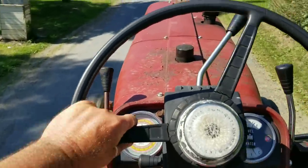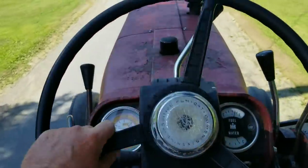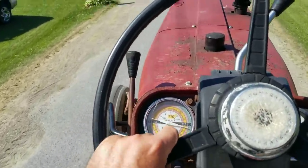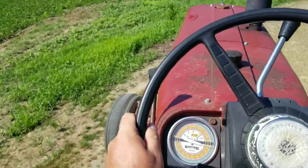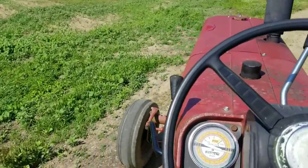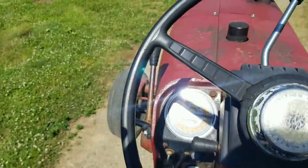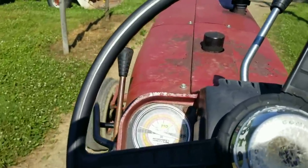You ever own one of these tractors, you want to keep them in direct drive, keep that lever forward. I see a lot of them parked and they're in the torque amplifier position, and that's not good for them. Hey, the moral of the story is, you got a tractor like this, 56, 66, 86, 06 series, you peel the sheet metal down, put your TA lever back on, and don't take 3 years to do it.